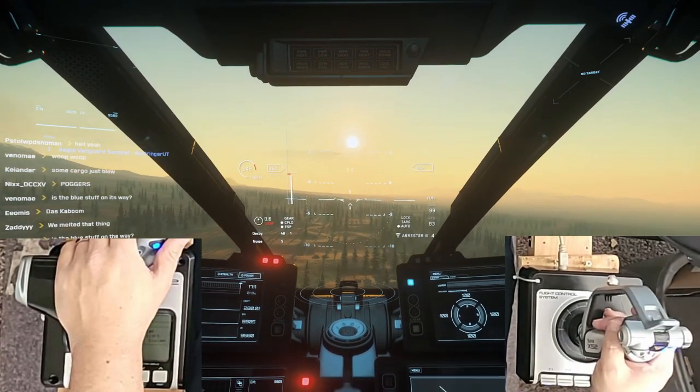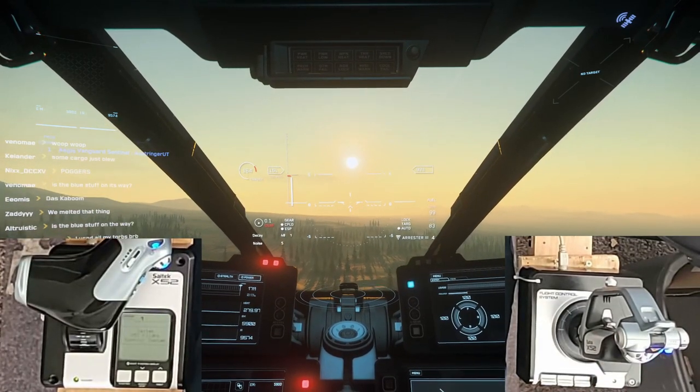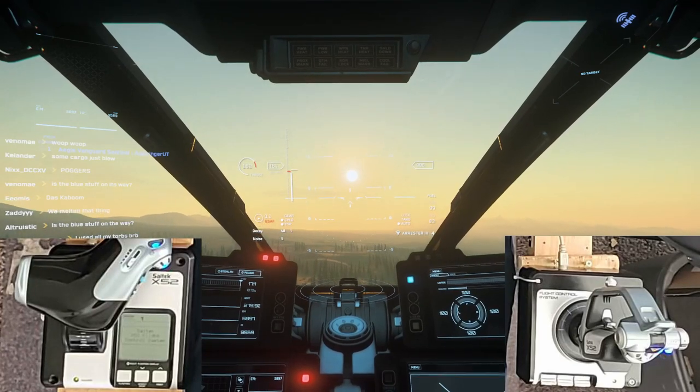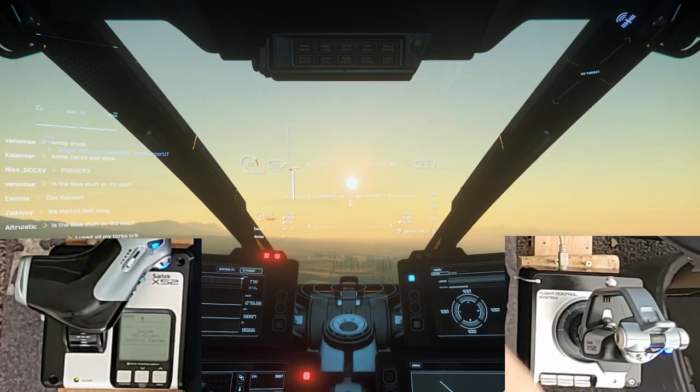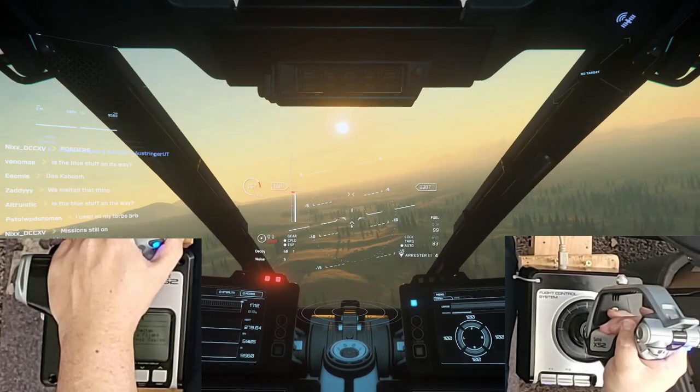We've been flying for a while, and now, hands off, you can see that one of our axes is drifting. This is due to the use of low-quality hall sensors. Most users mitigate this behavior by resetting the axis or setting a larger dead zone.